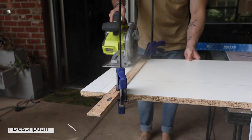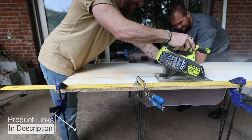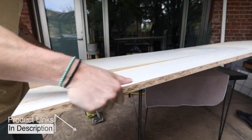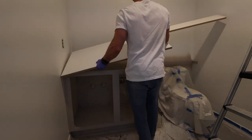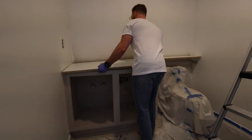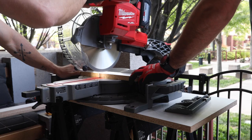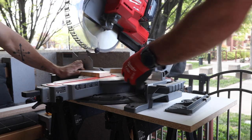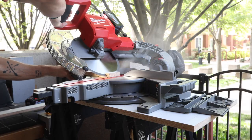Now I am going to focus on the base and the main shape of the countertop. I used a circular saw and a jigsaw to make the L shape I was going for. I dry fitted the base to make sure I was going to be happy with the size and fit. I went with about an inch and a half overhang and it all looked great. It was now time for a miter saw lesson to cut the rails down to their final sizes. I did a 45 degree miter on two of the ends — you will see why later.